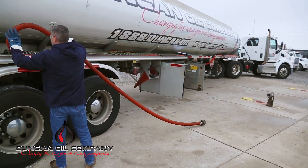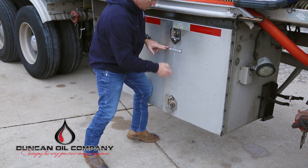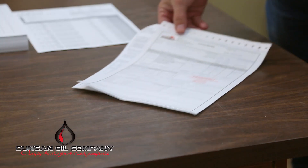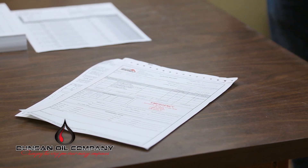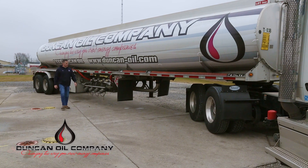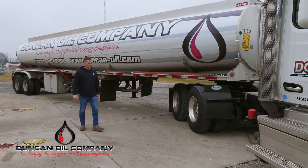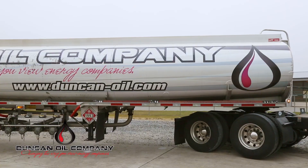For each separate underground storage tank, repeat. Return all safety cones and safety equipment and secure properly on the unit. Provide your customer with copies of the delivery receipt, the shipping documents, and a certificate of analysis if applicable. Complete a final safety inspection walk-around of the entire unit. Check your next destination point and pre-plan an appropriate route.